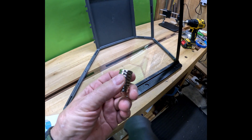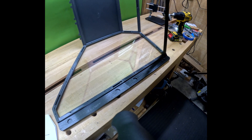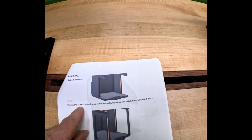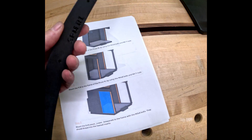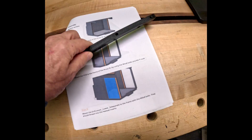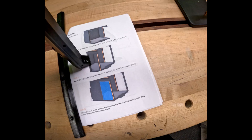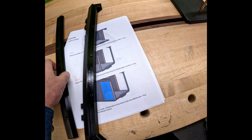The next step is to glue these rare earth magnets, 8 by 20 millimeters, into these openings on both sides using super glue. They have a very nice fit. Now to assemble the bottom section. For step one, we need the SPMs mounting to the frame — these are these pieces. We're going to take off that orange strip to mount that here, but we need heat inserts here so we can attach the polycarbonate frame. These pieces will fit in the front, and again we need more heat inserts here.